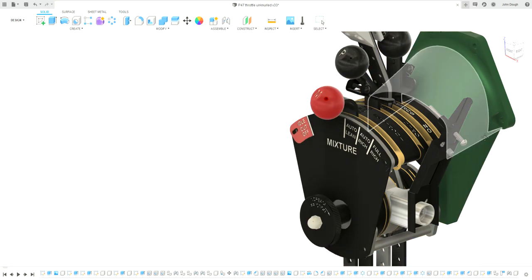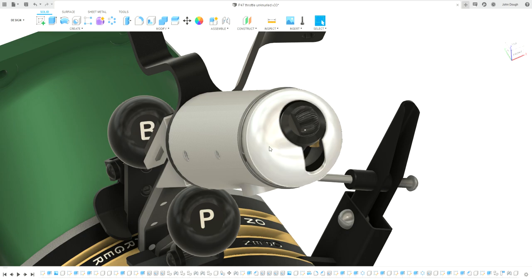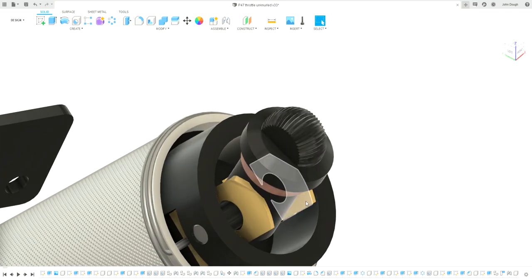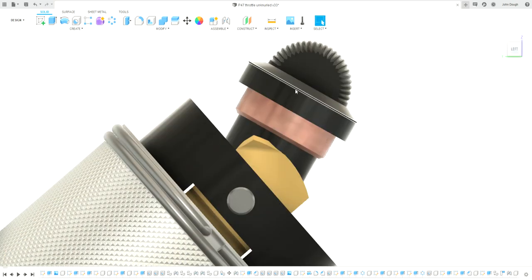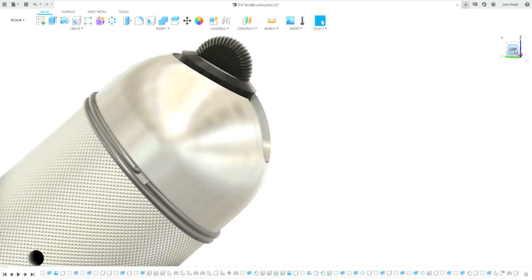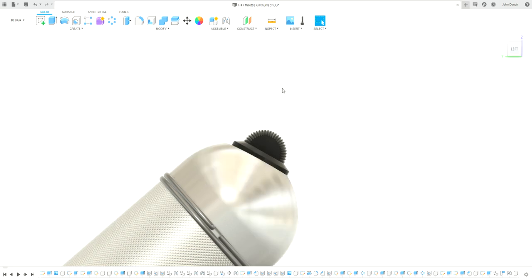Looking at the switch in detail — let's just remove this cap. You can see how this works: there are two brass contacts here and here, and on this plastic part — some kind of Bakelite — there's a copper or brass ring. When you push this down it makes these two contacts and that's your switch. You slide it under the cap, which has a recess under here, and that holds the switch on until you flick it back and it pops back up with the spring.